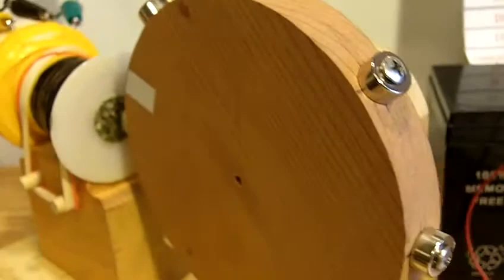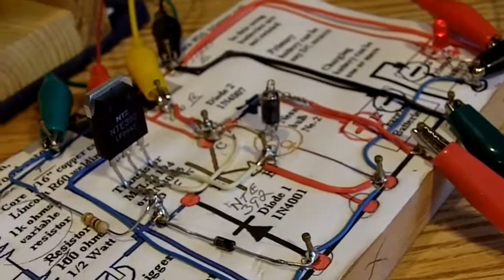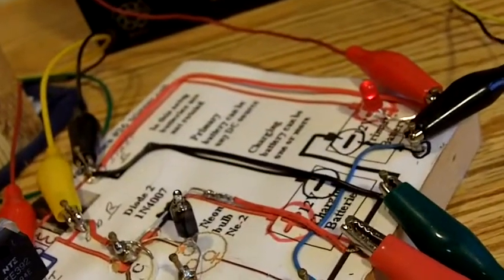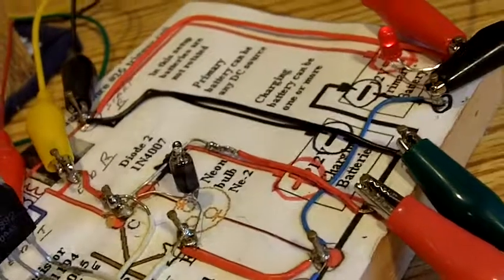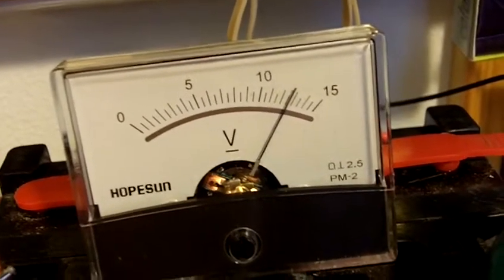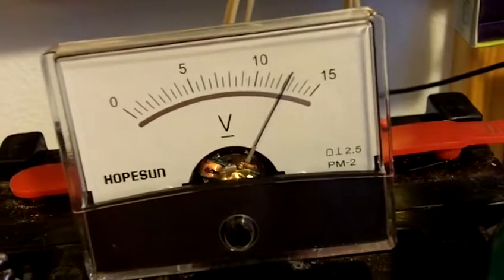On this one I'll power it up right here. This one runs about 1400 RPM on the fixed resistor. See the little LED here — I put it on just to remind me that it's powered on, in case I hadn't given it a spin to get it started. I can see they're both running pretty good. My charge battery is almost 13 volts now. I won't allow them to charge more than 14 and a half — I don't want to ruin the battery.